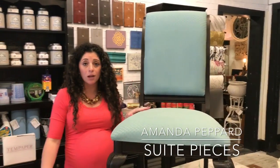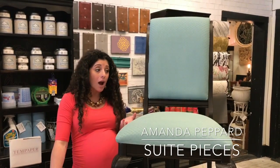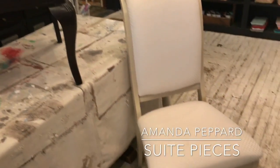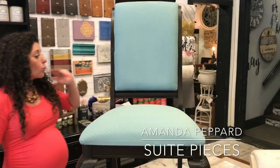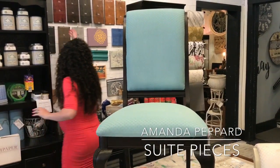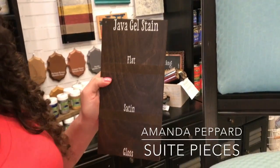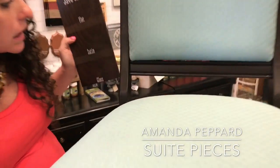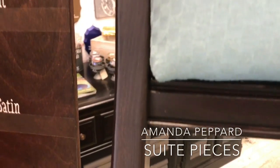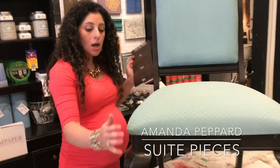I would just go over this whole chair — it's gonna take me just a few minutes, super simple. The other thing I just want to talk about really quickly is this frame. How much better does this frame look? We usually go from dark to light, but we just could not stand the way that light color chair looked, so we used the awesome Java gel stain from General Finishes on this chair over the white. We did two coats of Java, and if you look really closely you can still see a little bit of the white peeking through and some wood grain coming through. We finished it with the flat high-performance top coat also by General Finishes.